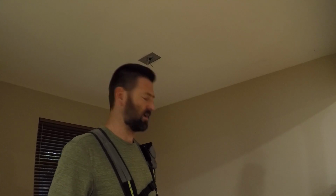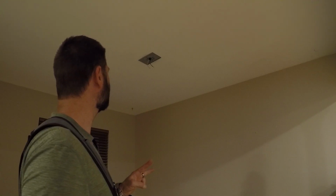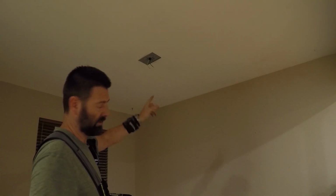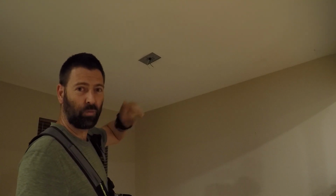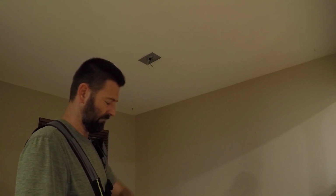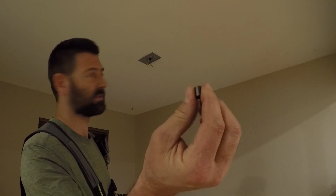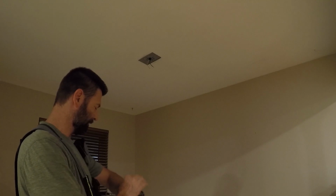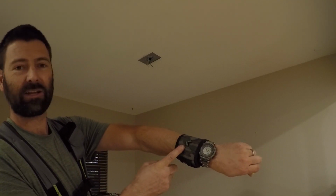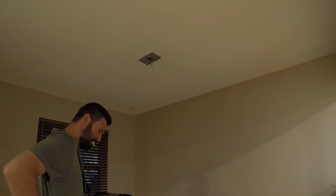This is where things get fun. I've got to hold this giant thing up there, connect up the 3 wires. The ground goes to the ground screw, smooth goes to the black, and the ribbed rough one goes to the white. Then I've got to use these 2 little guys here. These are the decorative nuts that go on those things that stick down. Those will be on my magnetic wristband. Link in the description. These things here, going in my mouth. All right, let's do this.